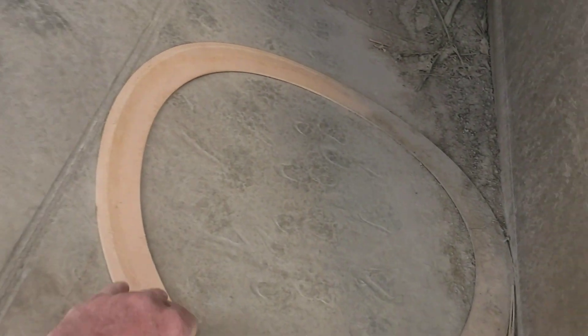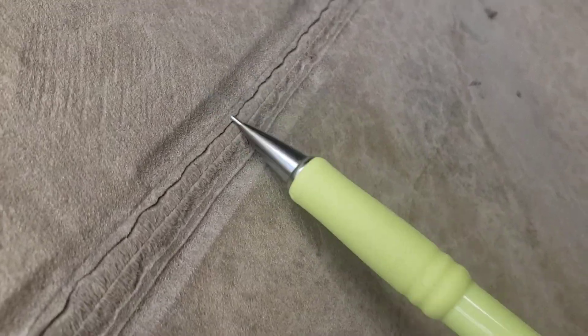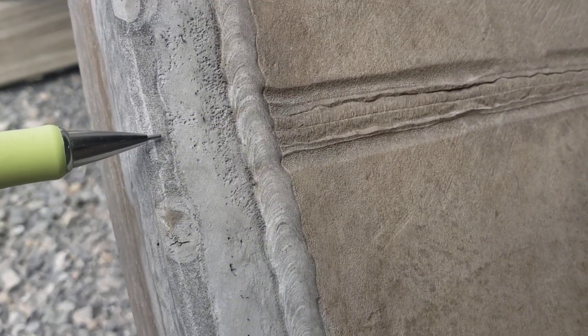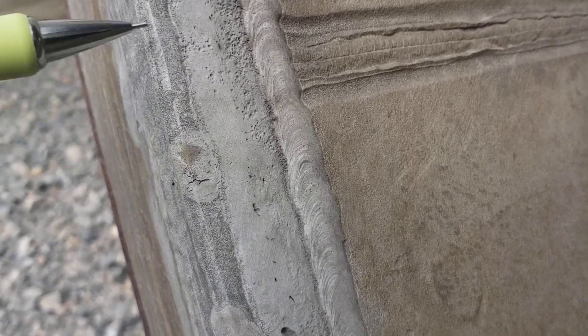Let me get down here and move that gasket so you can see it better. You can actually see in the topography between the base metal, the rosette weld, and the weld zone area that the long seam has been eroded and corroded preferentially — we're missing a complete pass right there.